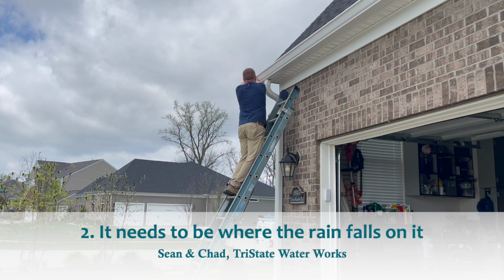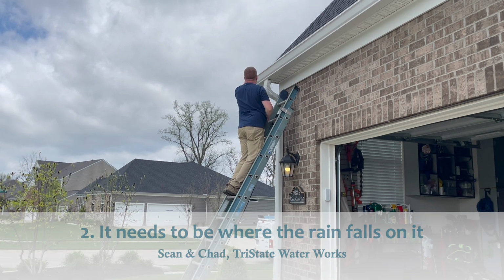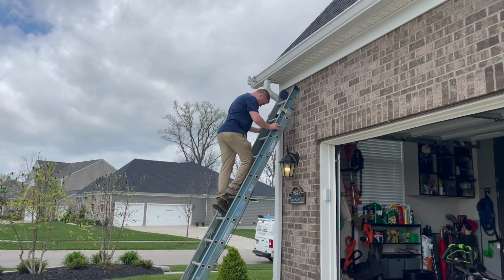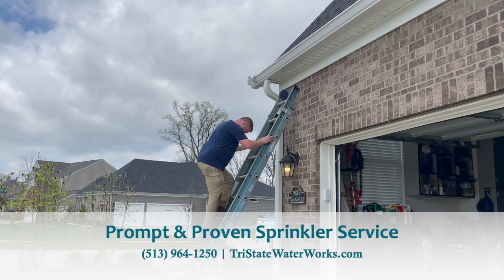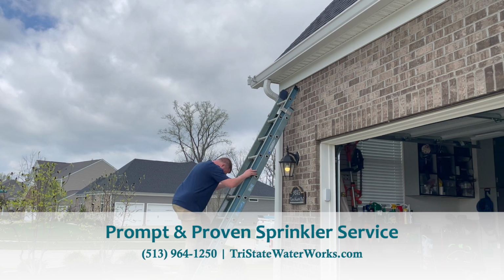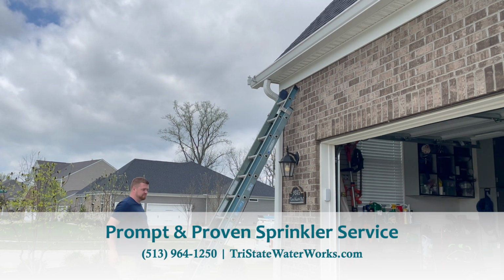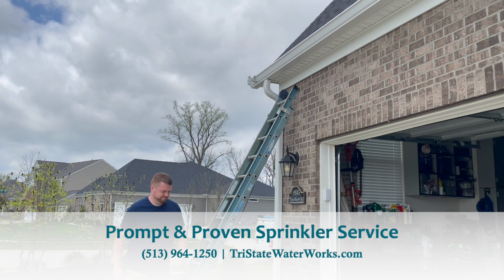Sometimes I've seen people put them on the side of the building underneath eaves, where when it rains, the rain doesn't hit the rain sensor. This is a perfect location because it's right out in the open, so any rainstorm that comes along will hit the rain sensor, and it's also within fairly close proximity of the controller, so it always has a good signal.